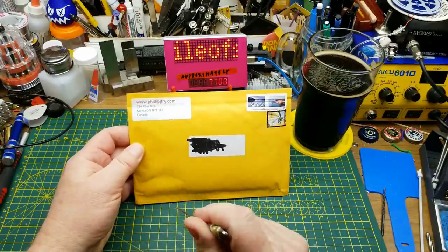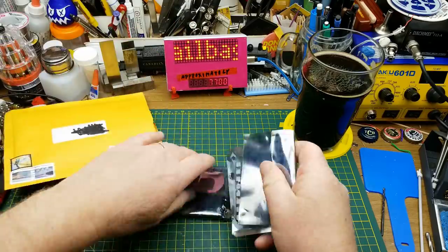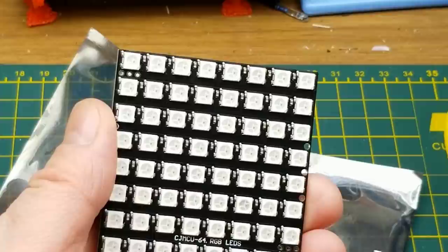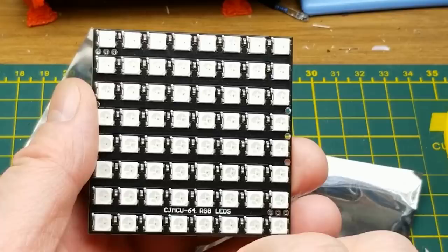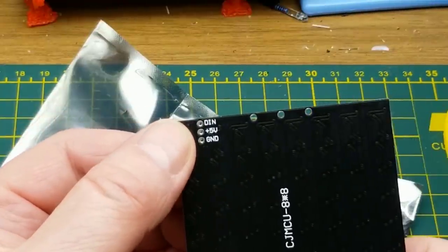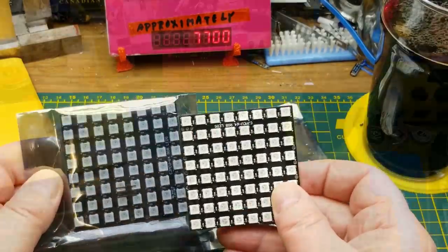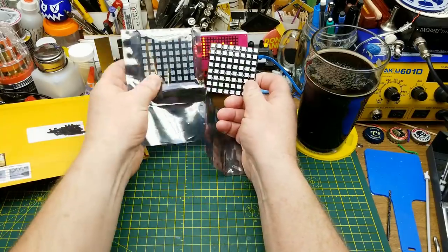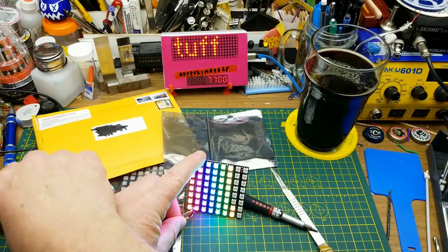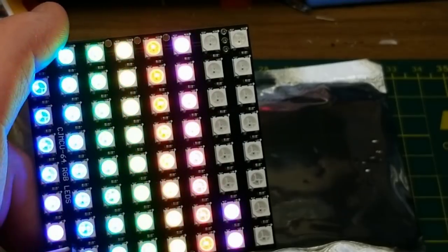Next in comes from Philip J. Fry Company in Sarnia, Ontario — that alone is worth the price of admission. Some LED panels — these are 8x8 grid or matrix of RGB LEDs, 64 LEDs total on the panel. Judging by what's going on in the back and my memory failing, these are probably WS2812 LEDs, or NeoPixels if you prefer. I got two packages of them, so I can create a bit of a grid — that back there is three 8x8s. With a few more I could create a sign. Here it is lit up — I've only got it programmed for 50 LEDs right now, but pretty cool.